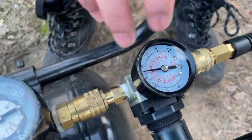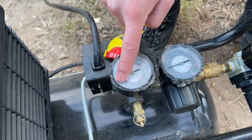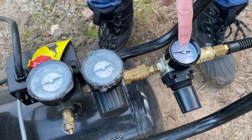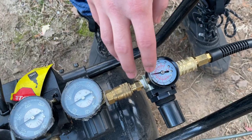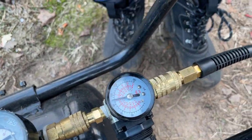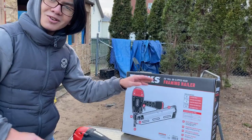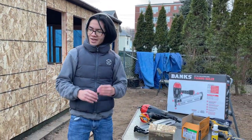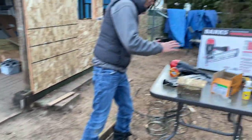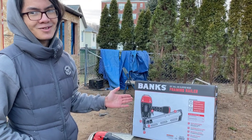What he did, per the recommendations of the internet, was buy a regulator which sets the PSI to a constant 85 PSI. No matter if you're at 120 PSI or 90 PSI, this is always going to be outputting 85 PSI — always constant. This regulator is adjustable for any PSI, but it's important that you do not set it below 70, because the nailer only takes 70 to 120 PSI. You don't want to go above 120 PSI or you encounter double nails — and if it's above 120 PSI, it might explode. We'll put the link to the regulator in the description.